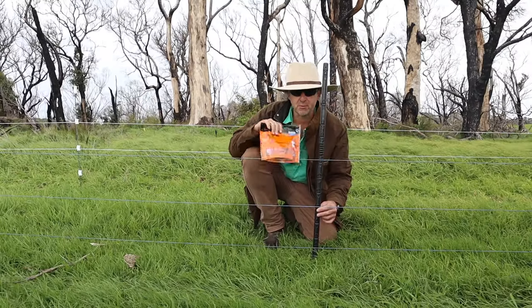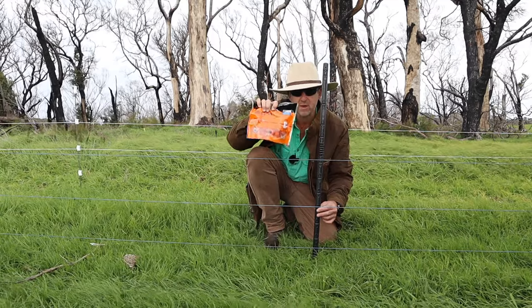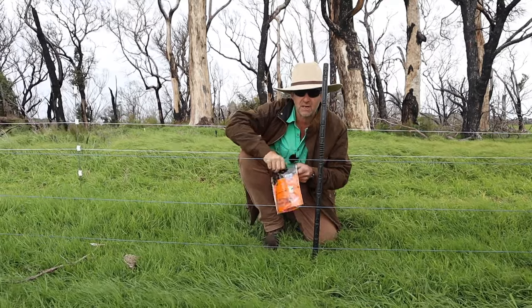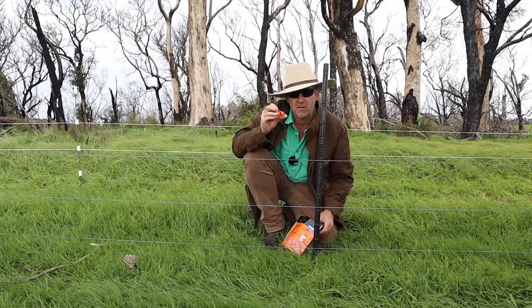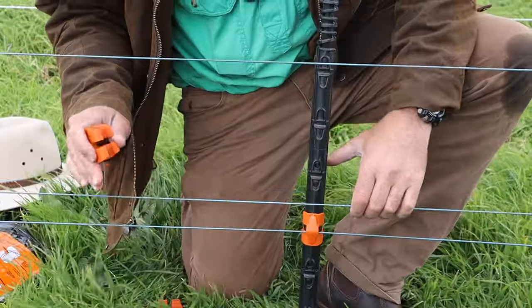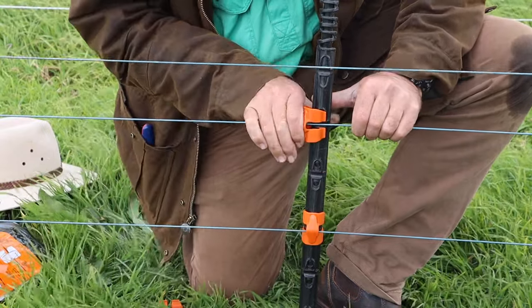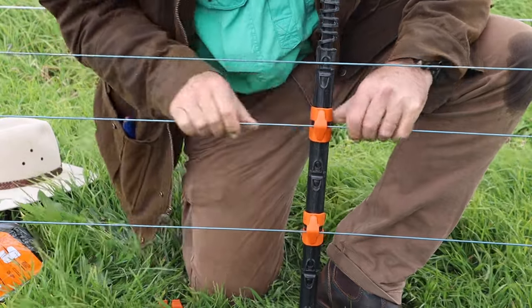Attaching the wires to these posts is pretty easy — you will have to buy some clips specially made for the post — but they're a really strong clip reinforced with fiberglass and nylon so they're guaranteed to last a long time. And if one does happen to break, because they're separate you can just buy some more. Putting the clips on is pretty easy: just seat the wire in the groove, put the clip over the top of the wire and roll it around onto the post. Job's done.